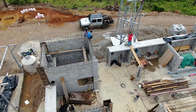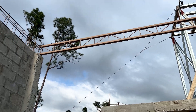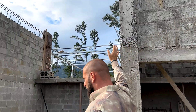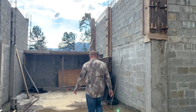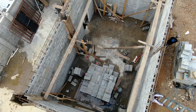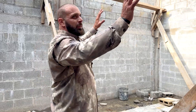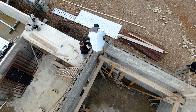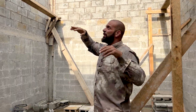I've built these joists, and these are going to be used on all of the open areas of the shop. The closed areas — like the office — are going to have horizontal columns, the same kind of thing up there. Come in here into what will be the photo and video studio, and I'll show you a closer look at how we're doing the sealed parts of the building. The roof here is going to be completely sealed — a concrete horizontal beam — and the rest will have the welded joists I built, but these sections will be concrete.